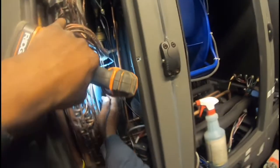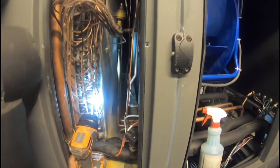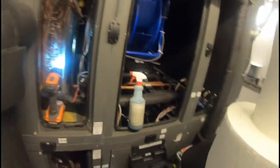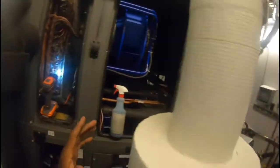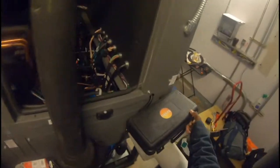There's a leak there. I hit it with soap but it's such a light leak. This unit ran for about nine months before it started showing refrigerant loss — we didn't know right away because the circuit had 23 pounds of refrigerant. Now let's bring out the Testo and see how it holds up.